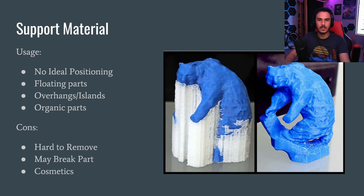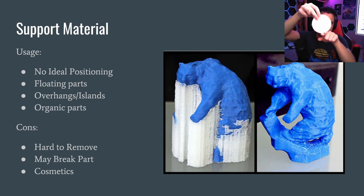Overhangs you can always deal with. Most 3D printers can handle an overhang of about 45 degrees — anything beyond that and the printer won't be able to do it. Think about it: you're going up and down, and at a really steep overhang, each layer has to go a lot farther out on the next layer to keep from falling over. Here it doesn't have far to stick out, so it can print. But past that limit it can't.